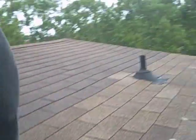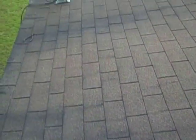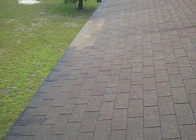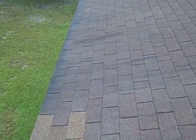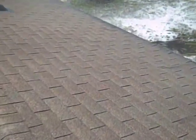But right now you can see that's soaking wet under there. The water's just sitting. It's really wet. So I'm going to give you a figure for taking out 3 feet of this. I don't know how old the trailer is, but this very well could be something you could go back to the manufacturer or maybe your insurance company and show them what the situation is. In my opinion, the water's going behind the siding, and if I peeled off some of that siding down here, anywhere in these areas, it would be wet, probably buckling and soft. But that's my finding.